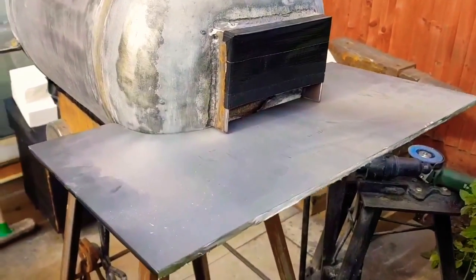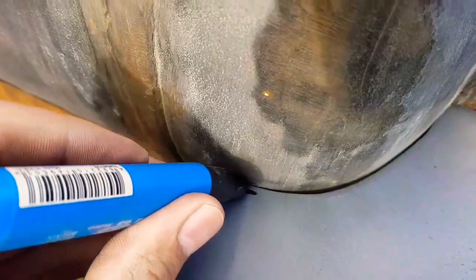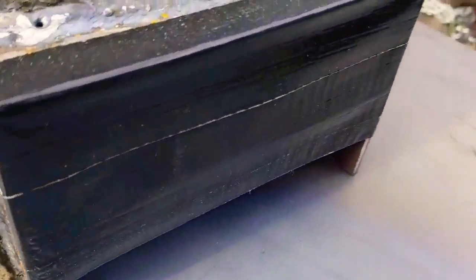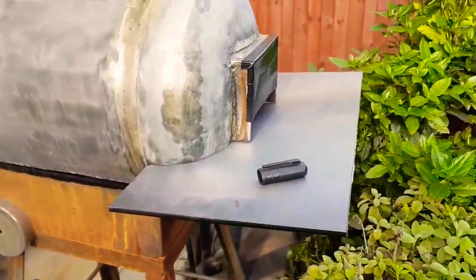There's the second one measured out. As you can see, it's still a bit of an upward gradient at the moment. So all I'm doing is marking with a pen just the areas here that need shaving back slightly, so that this can relax back into a downward gradient position. I need to shave back around there and probably the same on the other side, just along here. We'll take that back out and grind it back until we can get it fitting beautifully.